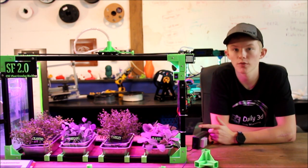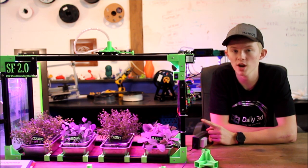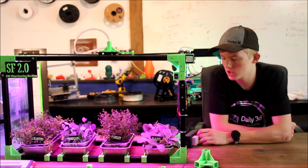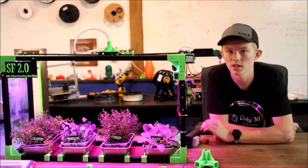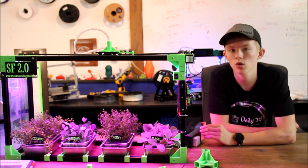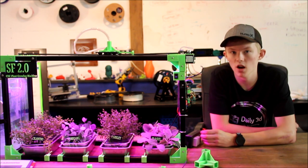The water pump turns on for 2 seconds, which pumps enough water up through the acrylic tubing through the shower head to water the plant. Then the relay is turned off to the L298N so it does not overheat when not being used. After that, the whole code is put on a delay since it doesn't need to check that often to water plants.